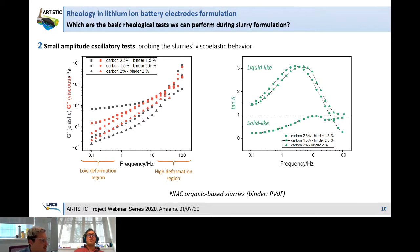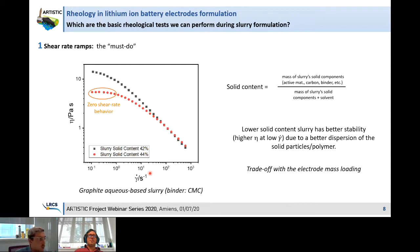Next question about the solid ratio: for this particular case study, the only thing we changed is the amount of solvent we add. We maintained constant the amounts of active material, carbon, and binder, and only changed the amount of solvent used to prepare our slurries. The solid content is defined in terms of the whole mass including the solvent.